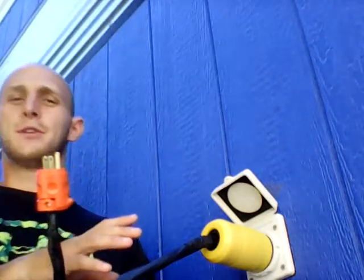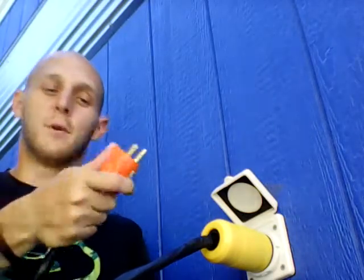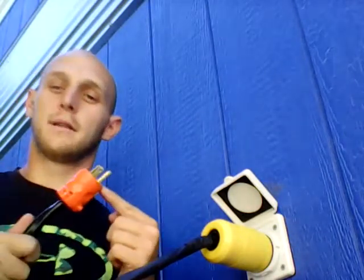It's still in DC power, so you need to connect your batteries to an inverter — an appropriately sized inverter for whatever you're trying to run in your tiny house. That inverter converts that DC power into AC power that you can use. The front of your inverter will have a terminal, basically an AC 110 volt outlet, that you can plug this right into.